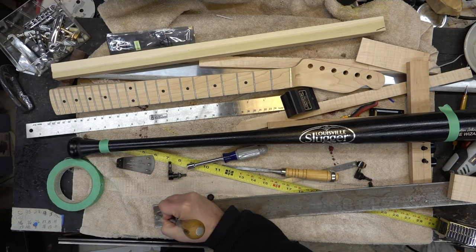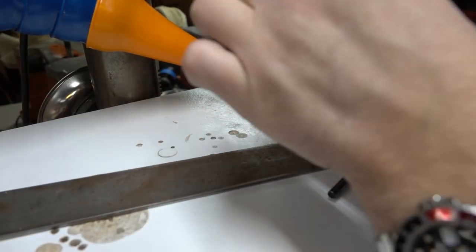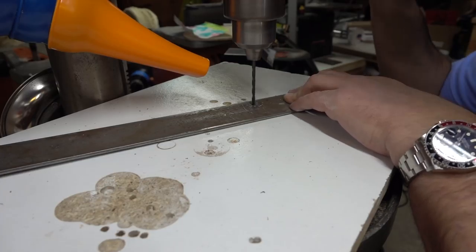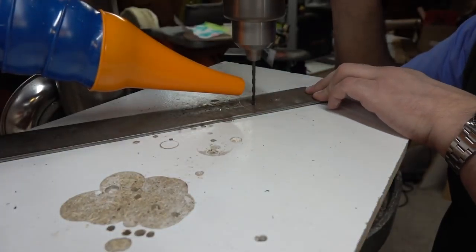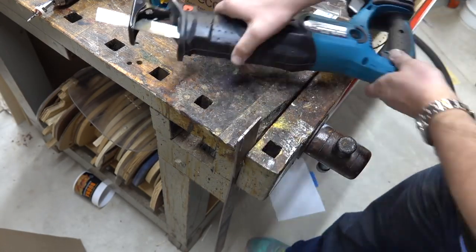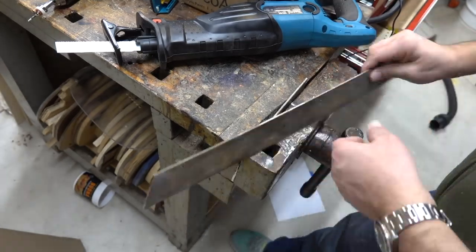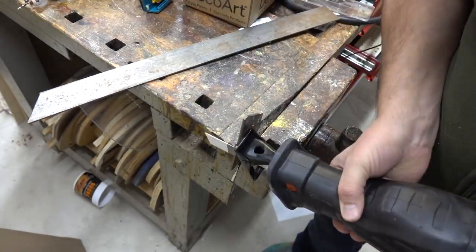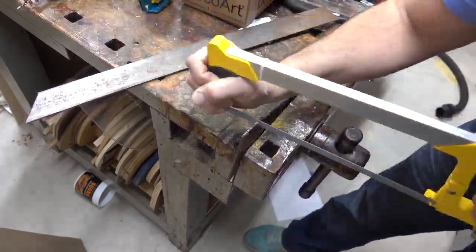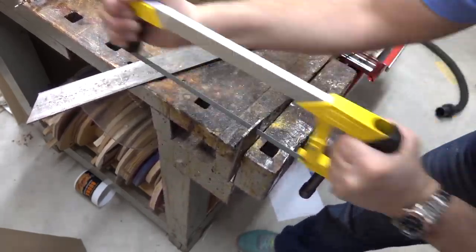Where the handle is, I'm going to screw in this custom piece of metal and then build a nut going up from the bottom of the bat. I didn't really know how I was going to do this, so I've got an awl and a piece of metal from Sears. We're going to lay this out, scratch it up, and I'm going to drill out here with a 3/16th bit. After drilling out the holes, I've got my sawzall trying to cut this out — that was a little bit of a pain. So we're going to cut this with a metal blade, which didn't work all that well. Coming back with a hacksaw actually turned out to be the quickest methodology. I also tried a Dremel, but definitely the hacksaw was the best way to go.